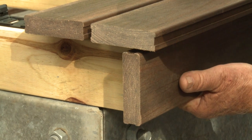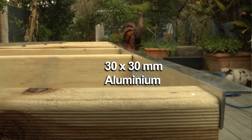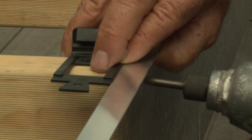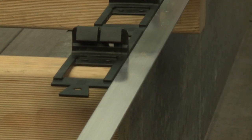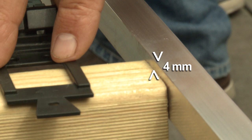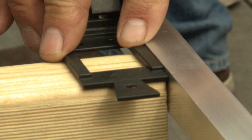If you've chosen the overhang method for your front board and have timber joists, use 30 by 30mm aluminium angle along the length of your deck. Drill holes through the aluminium angle at each of the joist ends and screw fix to your joist ends, making sure the aluminium angle is 4mm above the top of the joist, flush with the top of the rib of the CleverClip.